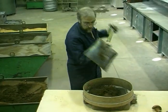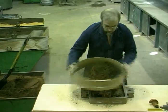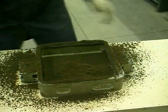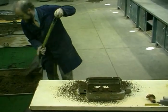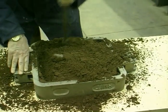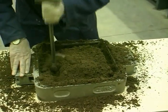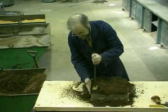Green sand, which consists of sand plus 2-3% clay and water, is sifted over the pattern and then pressed around it so as to obtain good shape definition. More sand is added and is compacted with a peg rammer, spiralling from the outside towards the centre of the drag. The last compaction of the sand in the drag is carried out using a flat rammer.